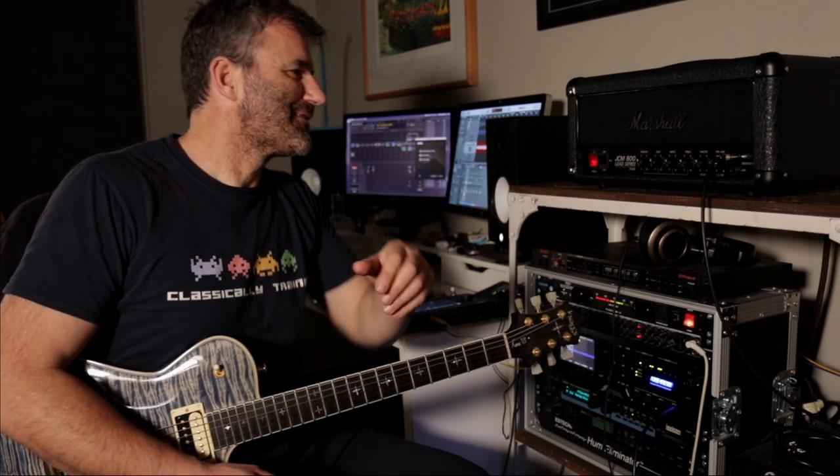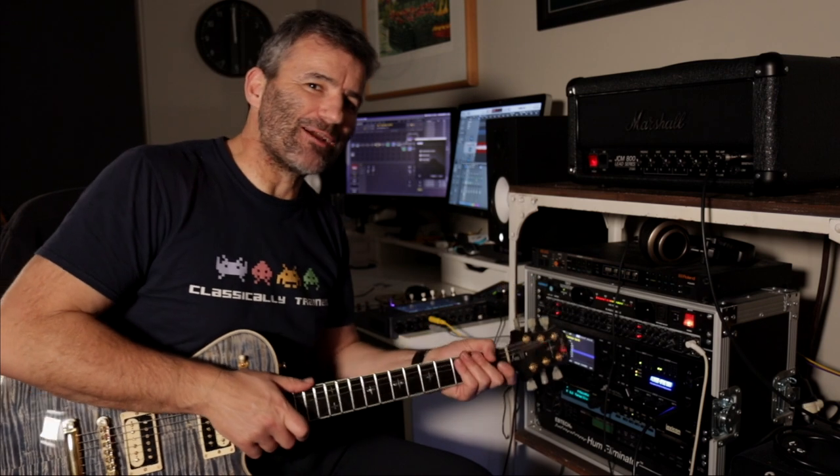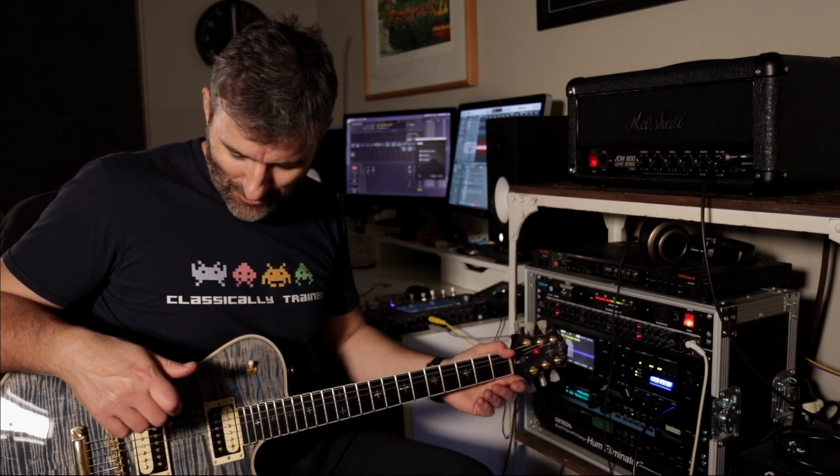34 to me, right? To me, that mod is all about the 100 nanofarad or 0.1 microfarad bypass cap on the 10K cold clipper, right? Second gain stage of a 2204, 2203 JCM800, which is what this is, right? So as a, I guess, a donor amp to make these mods to, it's a perfect start, right? Any JCM800, 2203, 2204 is perfect for this thing, right? So you get that kind of really gritty, gnarly sound, right?